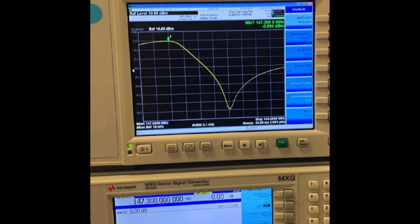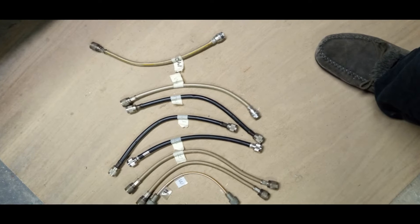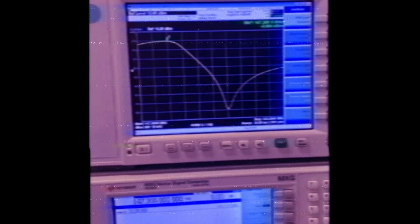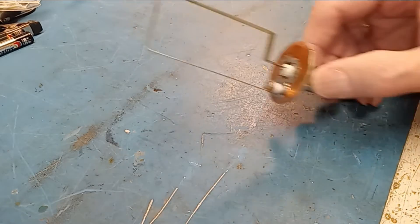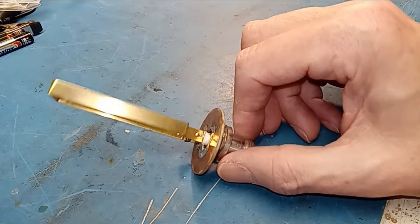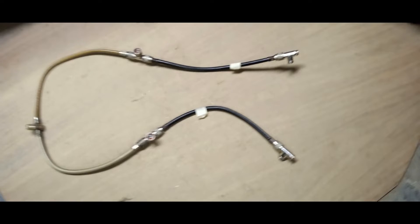Although the hybrid ring design works very well, it's also very complex to cable up and requires exacting cable lengths to get it to perform properly. The hybrid ring design is also no longer used by any of the duplexer manufacturers I have found for VHF applications. All of them use a bandpass band reject design that consists of an adjustably tuned coupling loop along with tuned quarter wave resonators and a much simpler cabling harness.